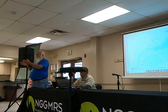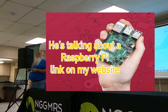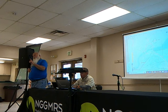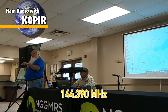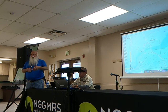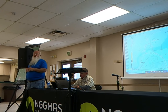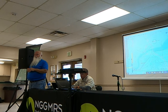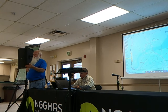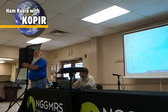Then you've got the software in the computer, a cheap laptop, or a Pi computer — I know a guy next to Nashville who promotes those Pi computers and they're pretty good at doing stuff like this. You have to have a two-meter radio capable of doing one frequency: 144.390 in North America. If you shop around, you can build that APRS system for probably less than $200, and it does a whole lot more than your handheld. The new Chinese versions coming out have perfected the transmit side of APRS but do nothing on receiving — with one exception: they'll let you hook up a sound card and a computer to the audio output so you can have a complete and full station.